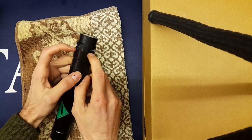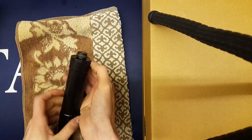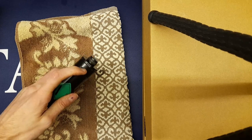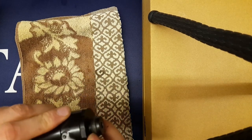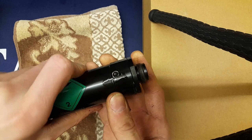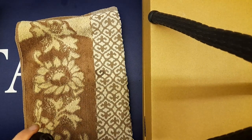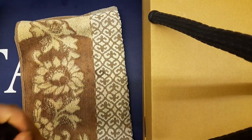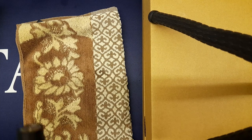It could also leak around this part of the cylinder and around here — there are two o-rings. I've never come across a leak there, but it could possibly come through those two holes. I've never ever seen a leak in there, but we'll check it quickly anyway. And lo and behold, there actually is a small leak coming up — you can see a bubble starting to form. That's a first for me. It just shows it's well worth checking absolutely everywhere.